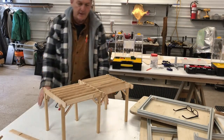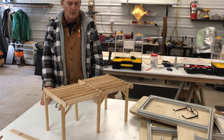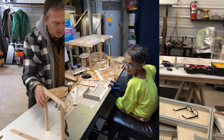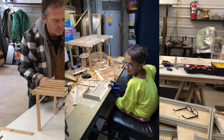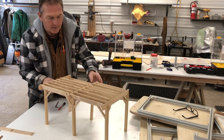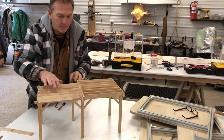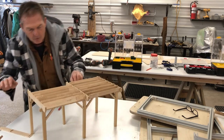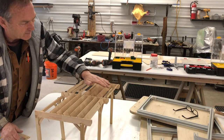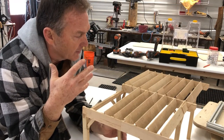My goal in the end was to build a great big timber frame deck. So I wanted to start with some smaller projects. I did a model of a pergola design I wanted to do first. Again, mortise and tenon. And I routed out a bunch of grooves in this so all of the uppers could flip depending on where the sun was. You could go back and forth with this. So as I said, I was trying to work my way up to bigger projects.